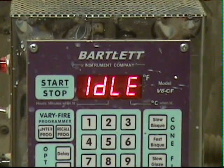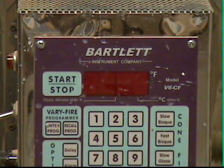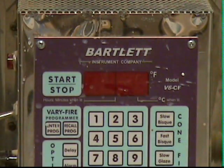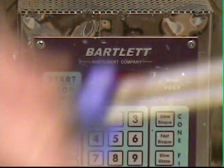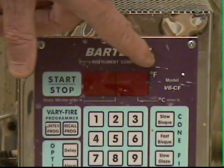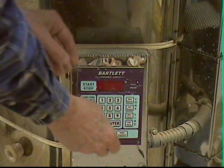How do you tell whether you're going to spend $45 or $250? The first thing you do is unplug your kiln, throw the breaker, unplug it — make absolutely sure that when you turn it on nothing happens and you don't have voltage to this thing.